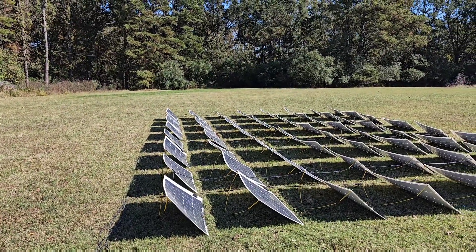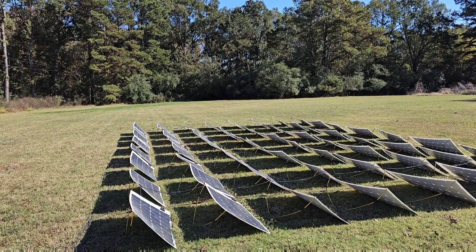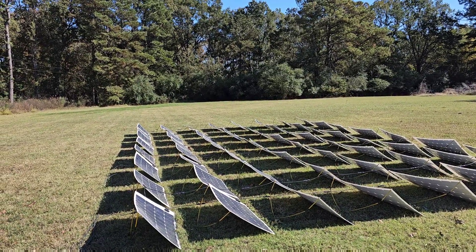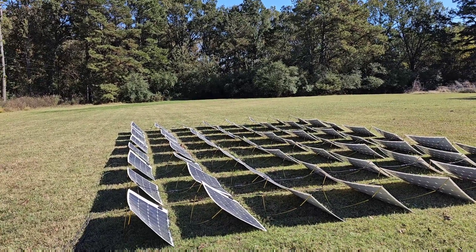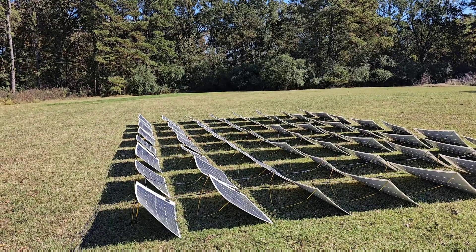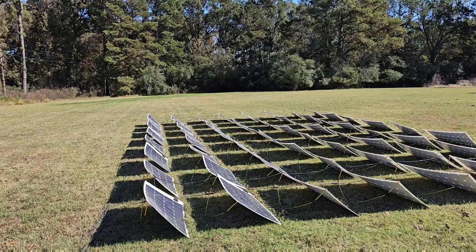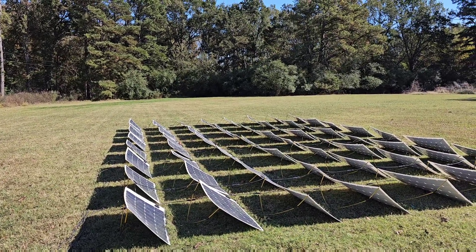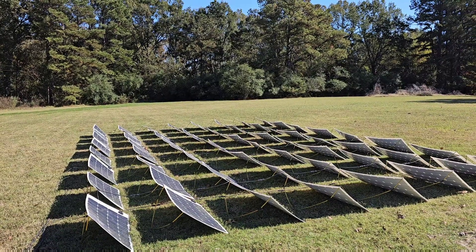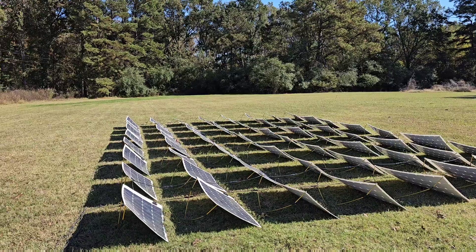In this case I've got two of them. Each one is 5,000 watts and my array is 6,400 watts, so I've split that across two so I have plenty of overhead for power. With two charge controllers, if one array is in the shade a little bit, each one can find the optimal point for each array. So having multiple charge controllers is a nice benefit. In this case, since everything is so symmetric they should all be about the same, but it's a good thing to have.